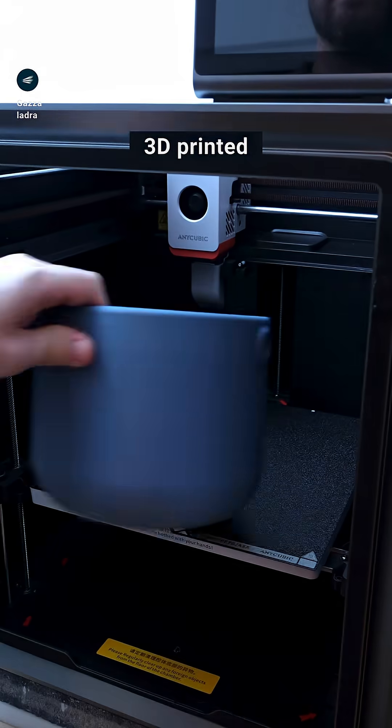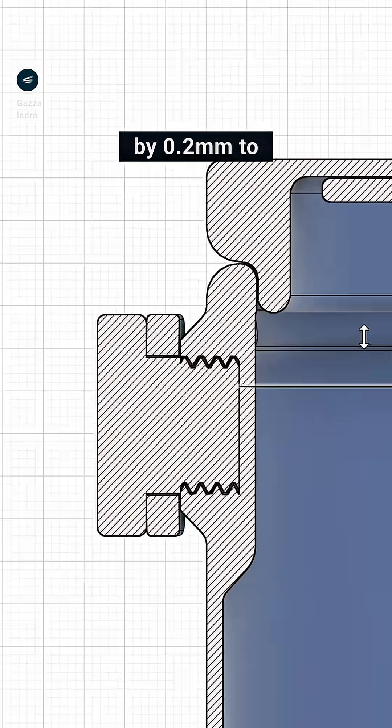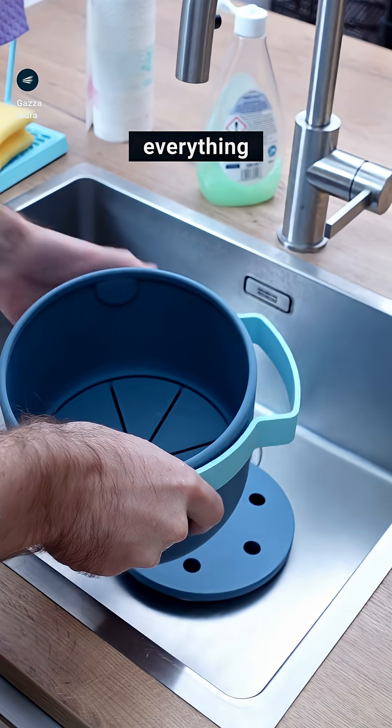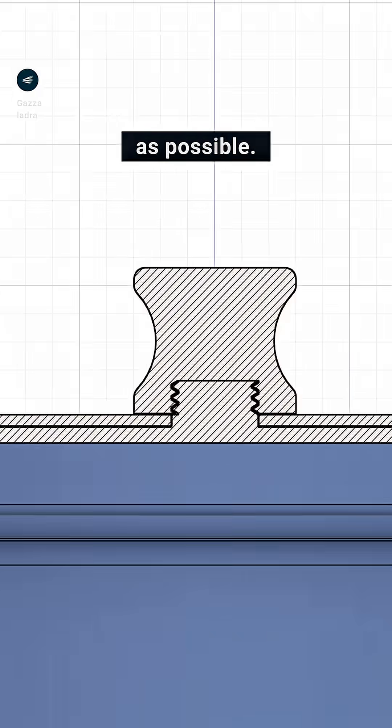Here's how I designed my fully 3D printed organic waste bin. To connect all parts I used metric threads that are offset by 0.2mm to be printable. This way you can quickly disassemble everything since my main concern is to get it cleanable. I therefore also rounded off everything as much as possible.